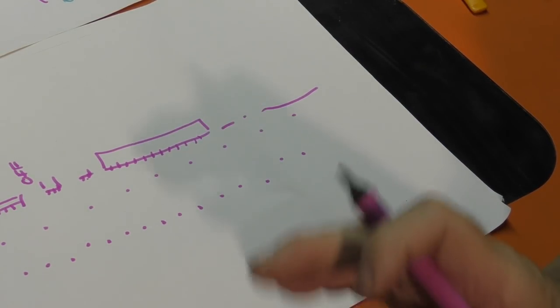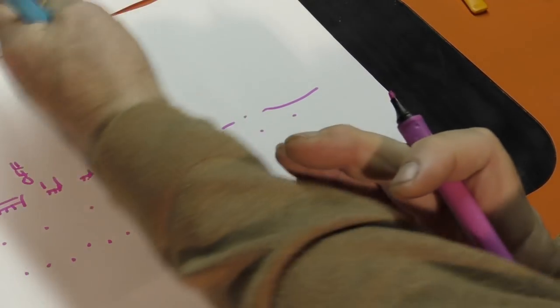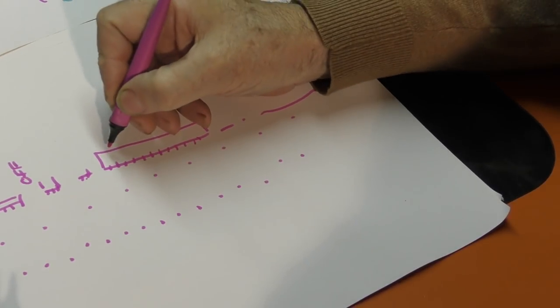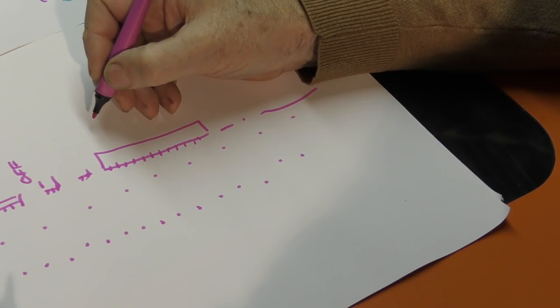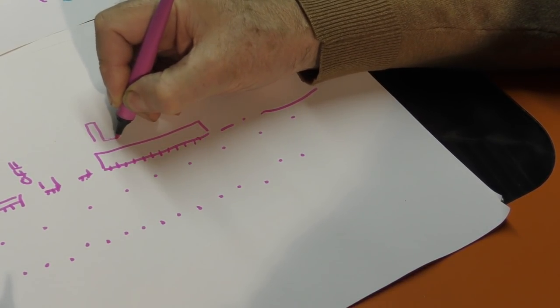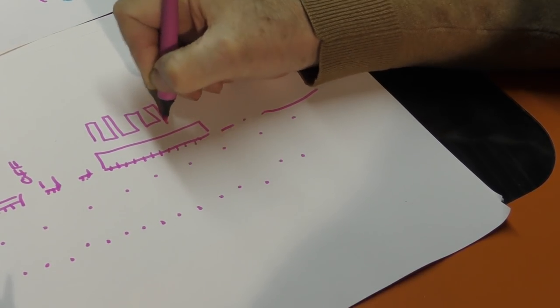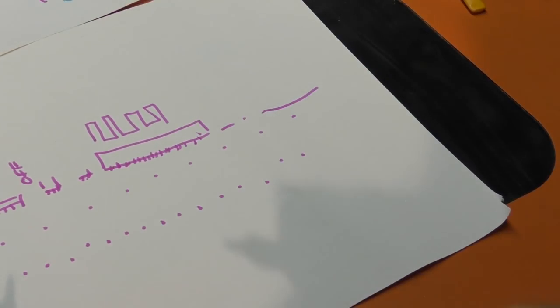not a series of pulses. So my point is that if I look at this signal that comes out of this power supply for a continuous line, perhaps it's not a continuous line. It shouldn't be a continuous line if the signal is continuously turning on and off and on and off and on and off. I should see breaks or pulses in that continuous line.